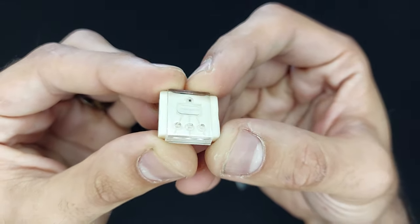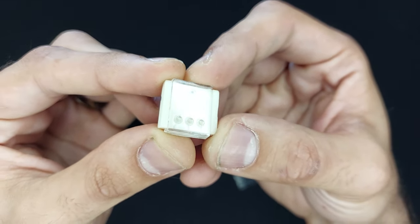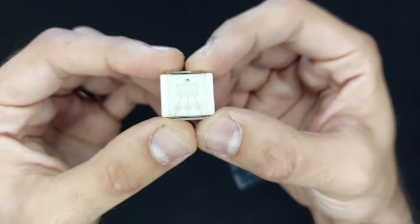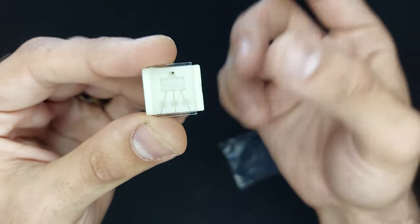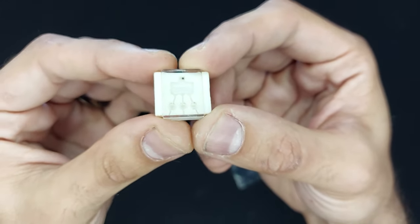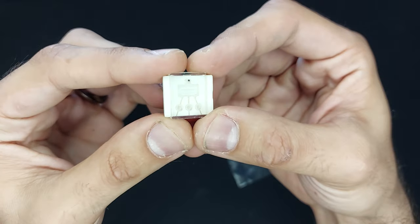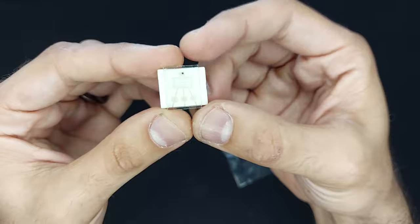And the tiny black ball of epoxy with the three leads, I don't even know if you can see the leads, is the transistor itself. And you're meant to wire bond this on whatever your ceramic substrate is, and integrate it into your application. And if you're developing a hybrid, this is a very consistently rated transistor, and you know that your circuit is going to behave properly when you start production.